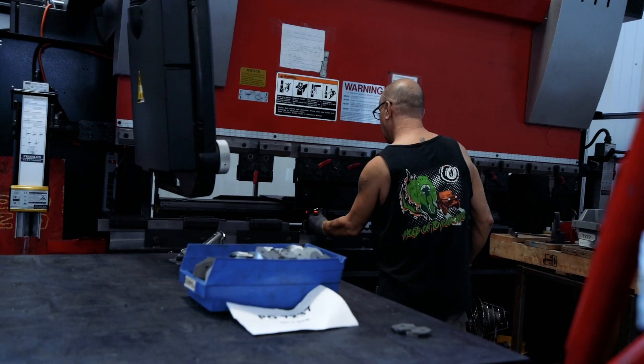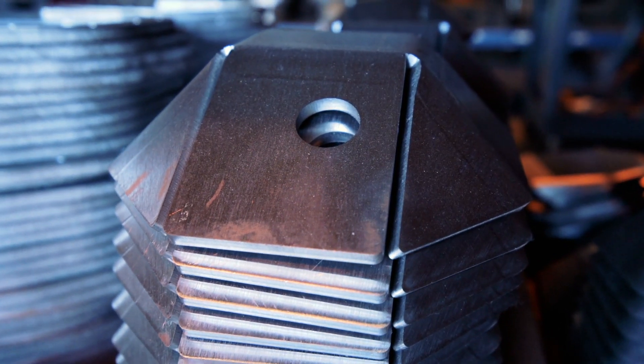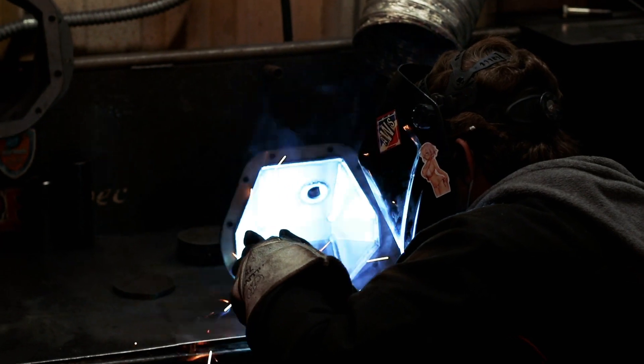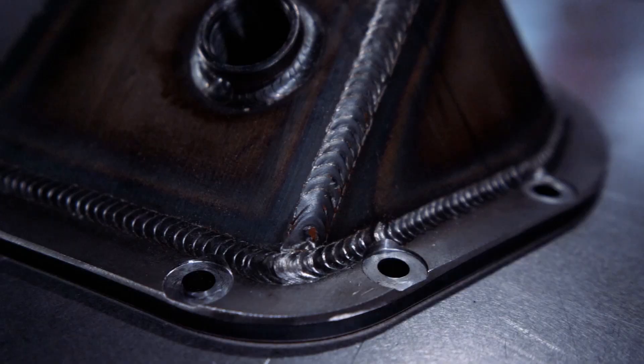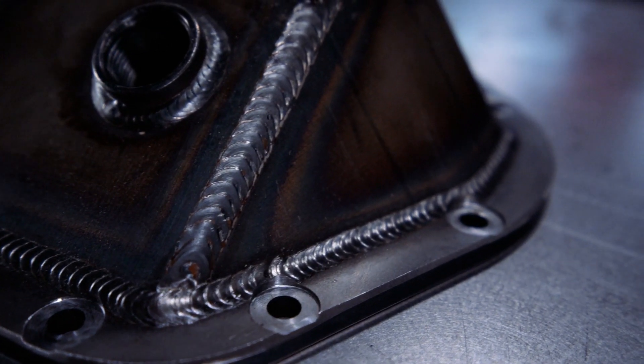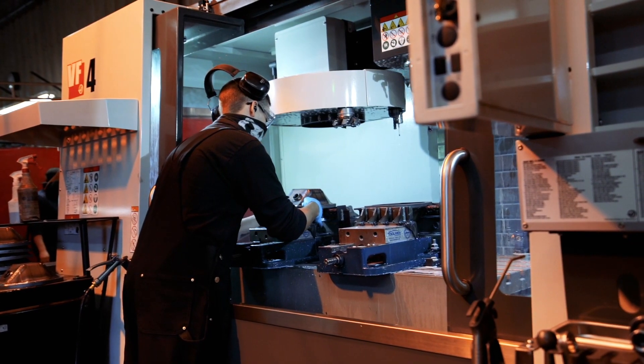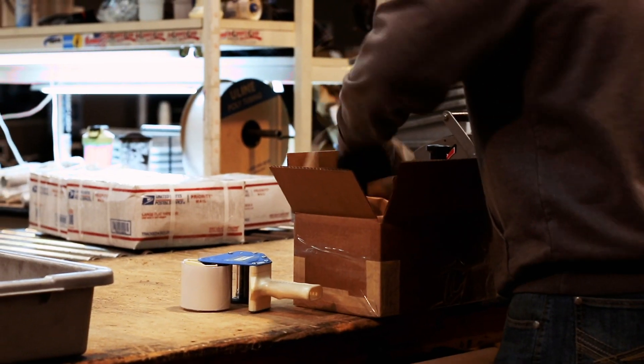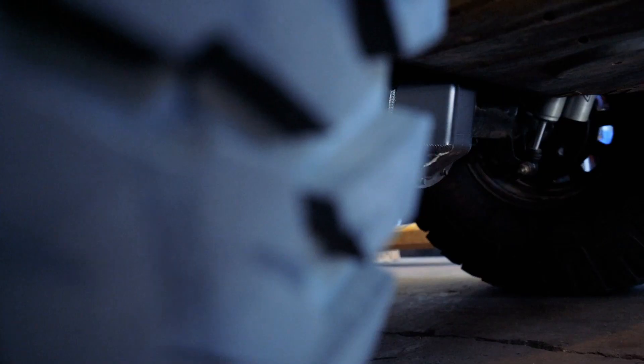Something like a differential cover is laser cut, then goes over to the press brake where it's formed into the shell. From there it's taken over to our machining department. We weld inside and out the shell, then weld the shell to the ring, and machine it until the face is ready to go with a perfectly flat mounting surface. From there it gets packed up and sent off into the customer's hands.